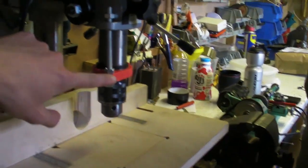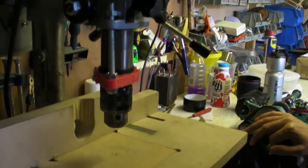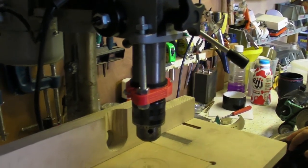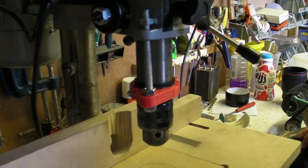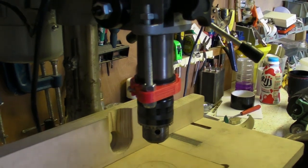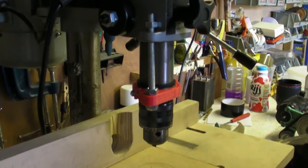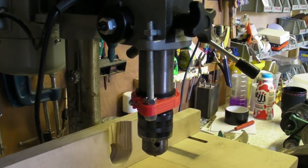Well initially I tried to build this out of wood and I completely ruined it - it was too bulky. This is just a much smaller, straight to the point kind of design. Because you start by drawing the holes rather than starting with a block and making holes in it. First you draw the holes and then you draw exactly the right amount of material around them to support them.